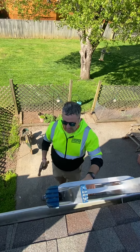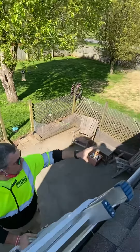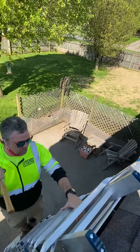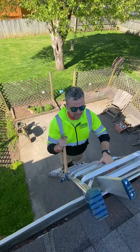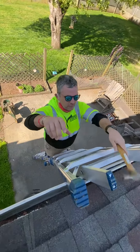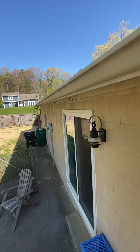Honestly, this is the best Masonite I've ever seen. I've been going up and down this back slope, tapping on these fascia boards with the butt of this hammer just to do a little investigation, going below and above in the gutter here. And so this is the only section of this fascia that is actually in poor shape — right at this chimney. It's kind of where the water got behind the chimney or something like that and rotted out this fascia board. All the rest of it is peeling, looks like crap, but it's in good shape.